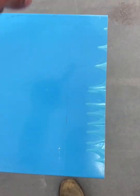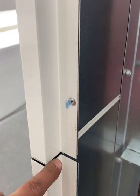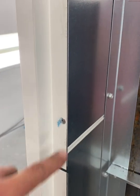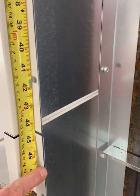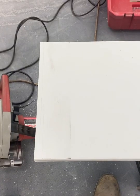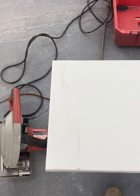You're cutting the end with nothing on — as you can see, it's open. Be sure to cut the top here. When measuring, you want to measure from here, as seen before, for the side panels. You're going to cut all top doors, the inside panels, to the same height — in this case, 44½ inches. Be sure to cut all panels with the plastic on to avoid any scratching on the face of the panel.